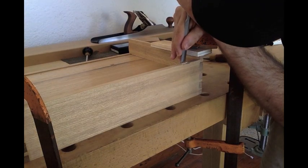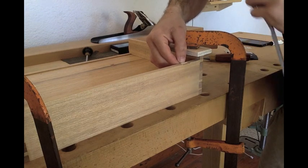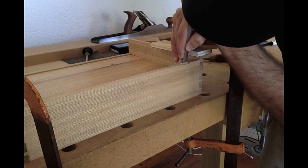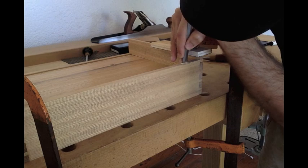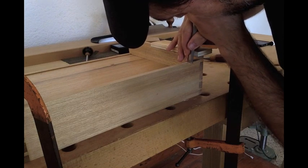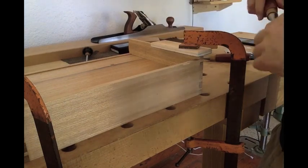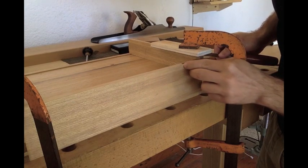And maybe just do a little bit of undercut. Don't touch the clean edge that is here on the top. Just undercut, leaving even just half a millimeter, and work in order that the hinge has got nothing, not even a small particle that keeps it away from the clean edge. Everything that is visible needs to stay clean. So you can undercut as well in these two sides, but then you have to use a smaller chisel that fits into this opening, because otherwise you can create gaps here and there.